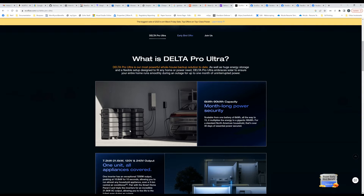Let's start with the picture. You can connect up to three banks to the new smart home panel, which is 12 circuits total. So if you did split phase circuits, I believe it's still going to be six split phase circuits. If you had all three banks, you could get up to 90 kilowatt hour capacity, which is fantastic. For my house, that would be more than enough.